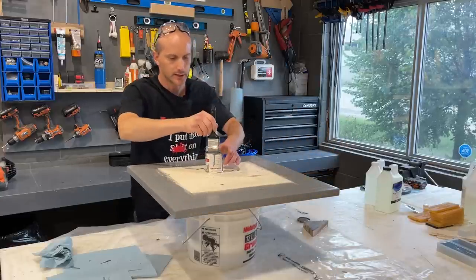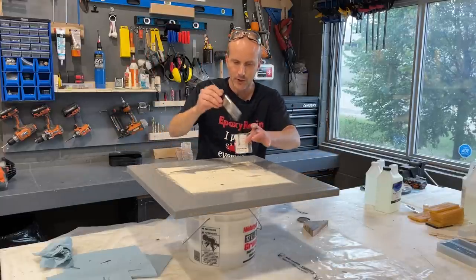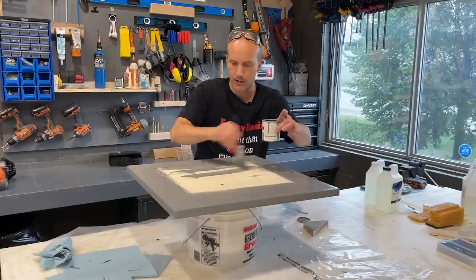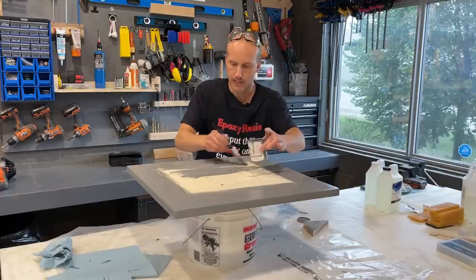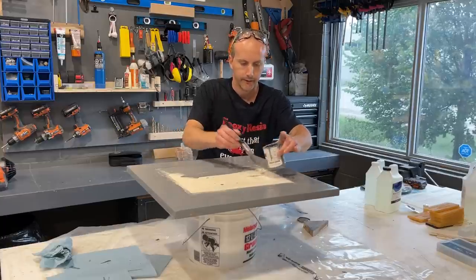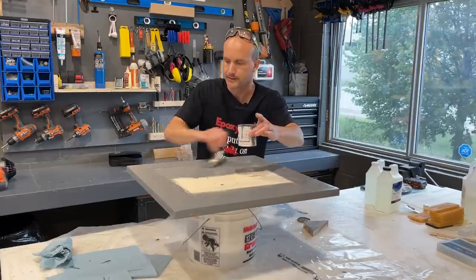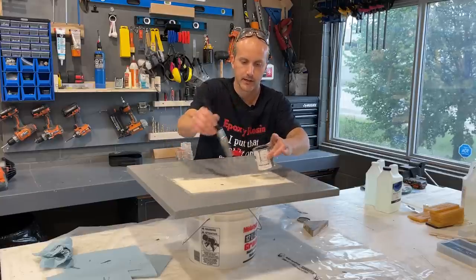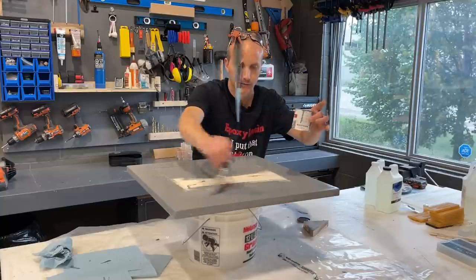I'm also gonna do this plywood. Even though you're probably not gonna see it, if we do have any translucency in that resin at all, I wanna make sure you're not gonna see a deviation between the dark finish exterior and then the middle interior. Only takes a few seconds to slap on some extra stain, so might as well just do it. That way we're guaranteed a consistent end result.